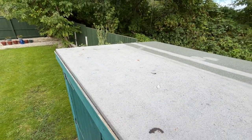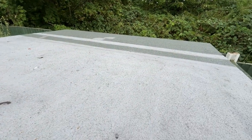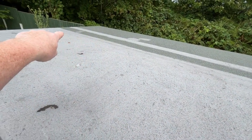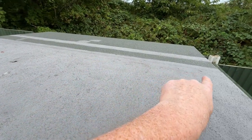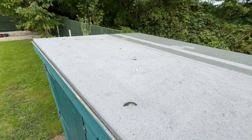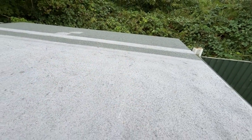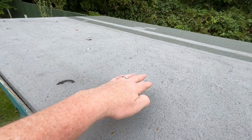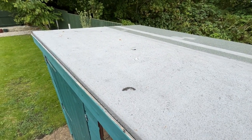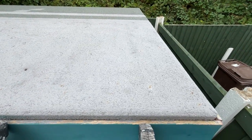So why is it like this? Well, after I posted the video, I noticed that we were still getting small traces of water through in exactly the same place. So I came to the conclusion that the initial joint - or row of staples more correctly - was such that there were still traces of water getting through. I found it hard to believe, to be quite honest. But I thought, we're here, why don't we just slap on the remainder of the tin and cover the full first half of the roof? Because we certainly weren't getting any leaking beyond that point. So maybe the leak was somewhere else on the top of the roof, and it was running down and causing the leak. Not really sure, but we had about half a tub of the sealant left, so I just slapped it all over. And that seems to have done the job.